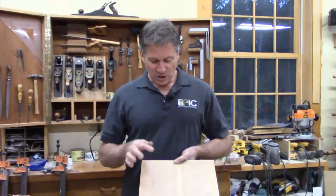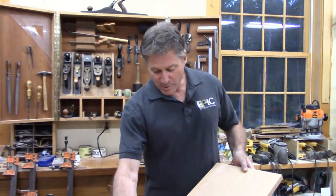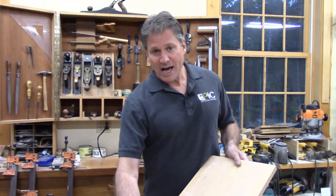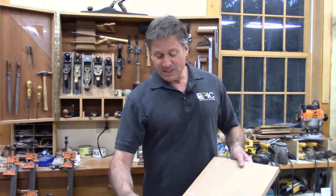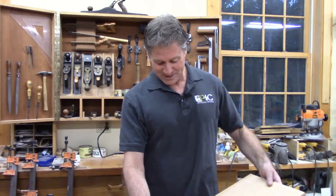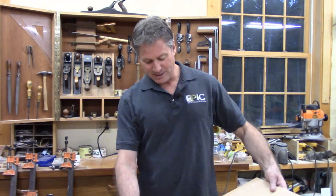So I want to show you with the biscuits, to put those in, you have to be careful that you bring them in far enough from the end, because sometimes if you get them too close to the end, when you go to square your board, you'll have a nice surprise. You'll see Mr. Biscuit showing up right in the end grain and say, that's an interesting figure. And then it will dawn on you that that's the football coming out to show its face. So you have to keep track of where you're putting them so they don't show up unexpectedly later.